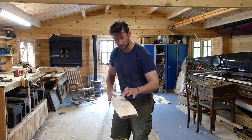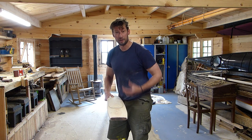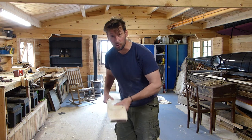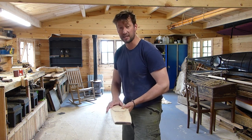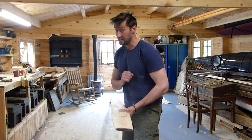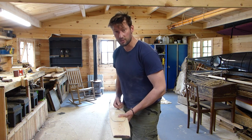Now, what I'm going to do is take the pilot holes from where those screws were. I'm going to open them up, drill them out so that they can be thick enough to take a lashing. Now, the lashing at this end of the paddle is purely and simply to allow us a solid securing point. If you imagine you're sailing along and this is laying on deck, you want it to be tied down very securely. And it's no good just wrapping ropes around it because it can eventually work itself free. If you've got some holes going through the blade, it is not going anywhere. Okay, so I've got a couple of big holes in here, we'll drill them out, get a lashing in there so we can tie it to the stanchion.